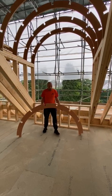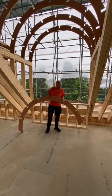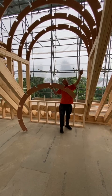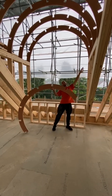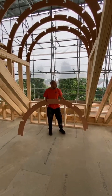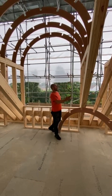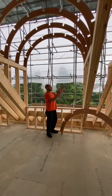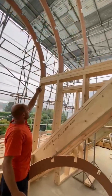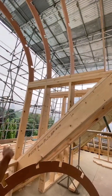Good work tips for doing curved dormers. Once we've got our template and everything's cut, you'll see we've got the notch at the bottom. We'll put our plate on top of our double plate at the door of the cheek — that way we've got something tight to go against, so it ties it all in nice. What I like to do is square through where my uprights are going to be, then cut a noggin in between on the inside. That way you can screw through and that will hold everything balanced as you work across.